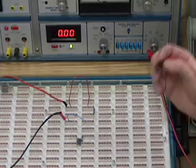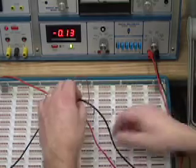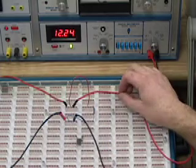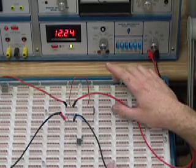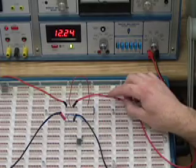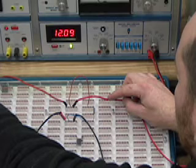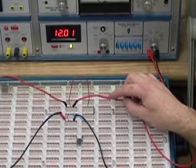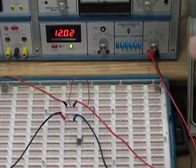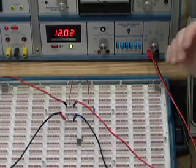So what I want to do now is I want to take the voltage measurement from the power source. So I plug it into the same manifold here and here. Okay, these nice junctions. And right now I'm reading about 12.24 volts. Some of this equipment's a little old, so when it says exactly 12, we might want to adjust it down. Get it as close to 12 volts as we can. Now, this indicates that my power supply is supplying exactly 12.02 volts DC.